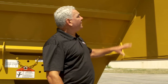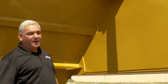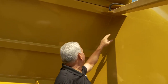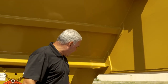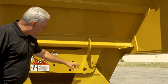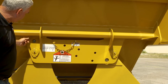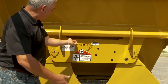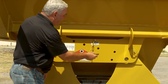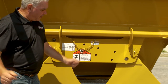A few more details make a Load King a Load King — our customers hang on to these trailers for 20 years, then trade them and they go on to their next life. We use tubular steel and brace in the corners. We use diffuser plates everywhere we have welds to prevent cracking. On our gate ends, every bushing is greasable. We also have drop pin legs for weight, and when you want to adjust your gate openings, it's as easy as pulling the pin on front and back and finding the perfect slot for whatever width you want.